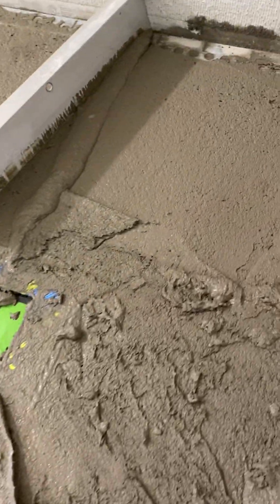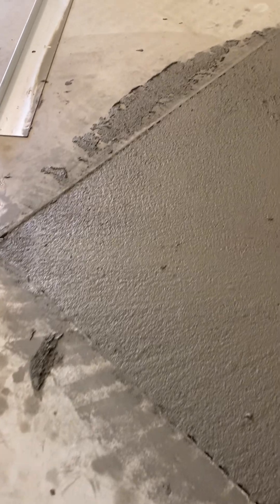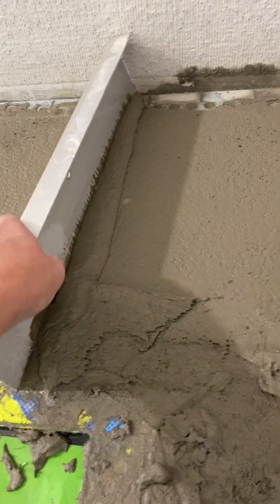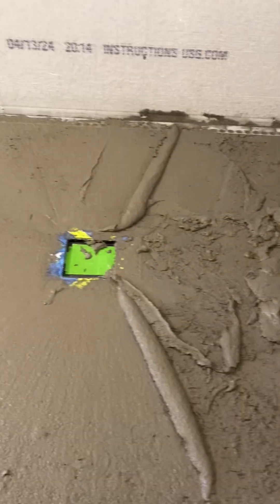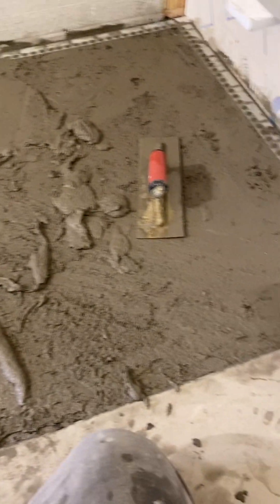Now I mixed up a thinner batch. I just kind of spread it on there, then take my screed and drag it across, filling in all the little low spots and imperfections. This is just going to roll right off the screed and fill it all in. It's kind of hard to film and do this while racing the clock. I'll coat that whole thing in about 15 minutes when it starts to fire off, clean it up with my flat trowel really good, run a straight edge around it again to make sure it's all nice and flat. That's kind of how you do it.